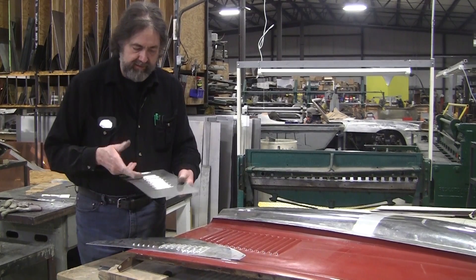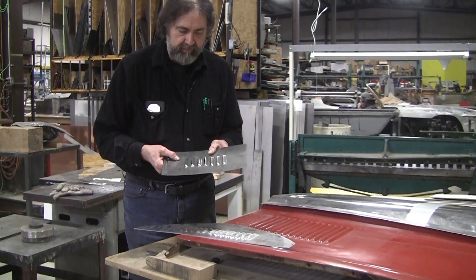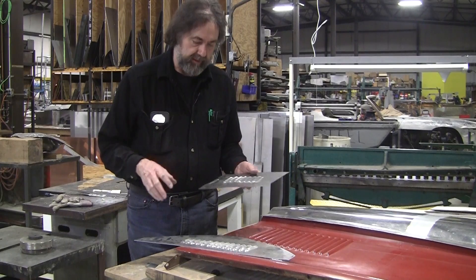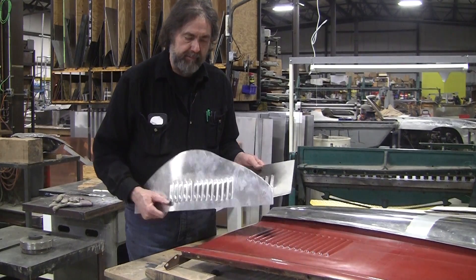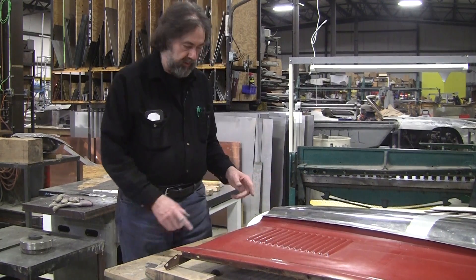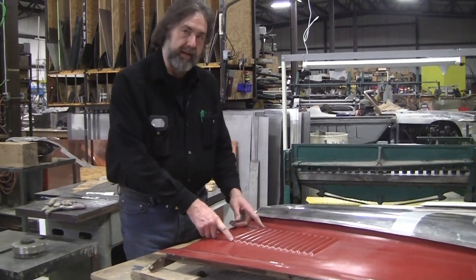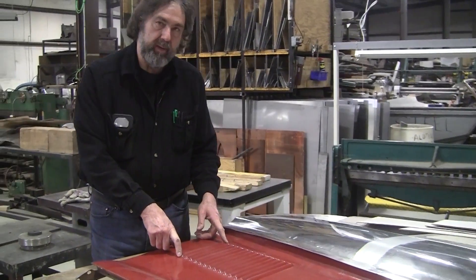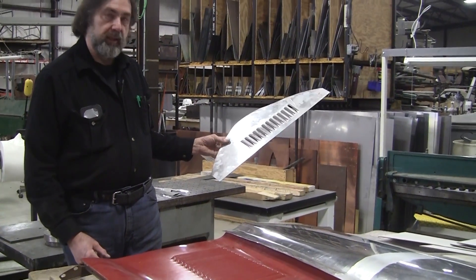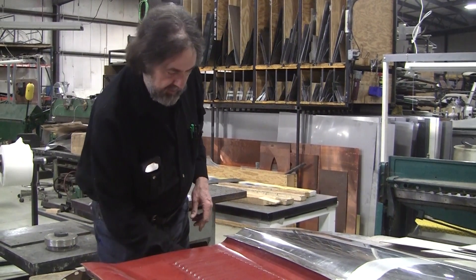That's on steel now — these aren't lined up because we just popped them out one at a time. Everything we did, we learned a new little fact about how to tweak the die. After we were happy with the three-inch results, we said let's make the eight-inch die. I only had a five-ton cylinder in the press, and that was cutting the three-inch in aluminum very easily, but we didn't know if it would cut the eight-inch.